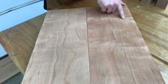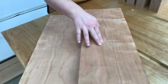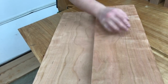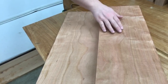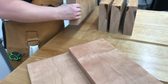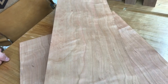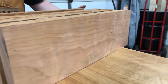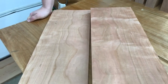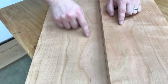We're going to get a little bit of this cathedral grain - that's not gonna be the end of the world. We're primarily trying to focus on as much straight grain as possible. Any time we're forced to include the cathedral grain based on the lumber available, we'll do so in a manner that has some symmetry so it doesn't just look lopsided. There'll be two panels side-by-side and the symmetry will really play off one another. I thought this was gonna have a lot more figure, but it's still got quite a bit - depending on what board you're looking at and the angle, you've got some curl going on in just about all of these. It's gonna look really good especially with the book match separated by that stile on the panels.